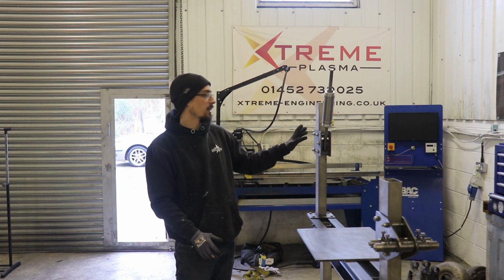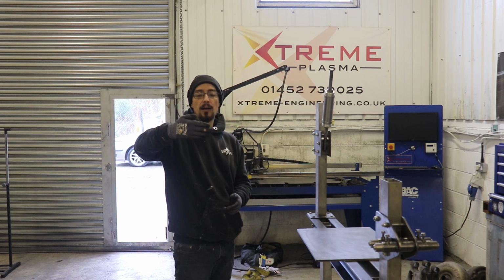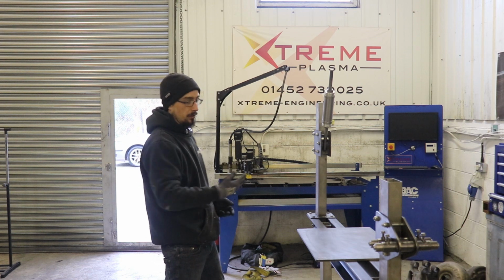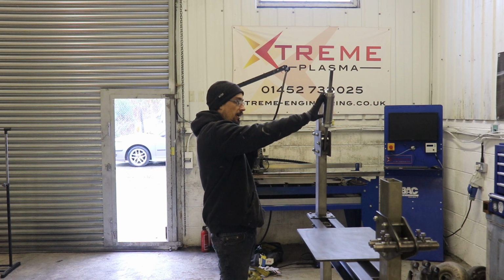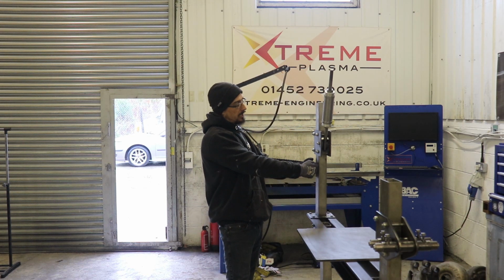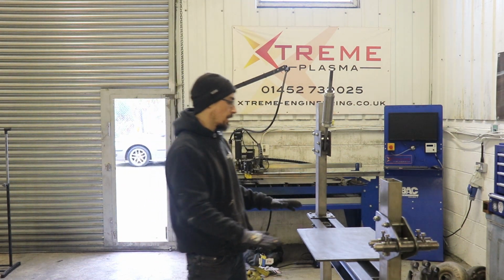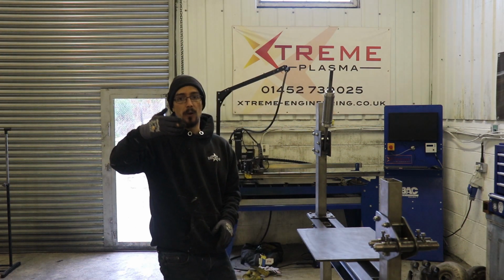I've got my jig all set for building the new frame. The old bike kind of sat with the, if you were looking straight onto the bike, the bottom rail of the frame was kicked up, so the whole frame was sort of tilting back. So what I've done is I've set the old frame into the jig to get the head angle and the height of the rear axle, and then I've raised this front mount by 50mm, just to drop the front, and hopefully that should be enough just to level the bike out. And I basically want this bottom rail of the bike to be close to level when the bike's fully weighted, sat on.